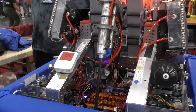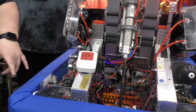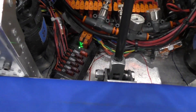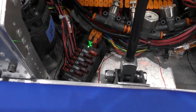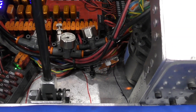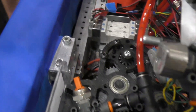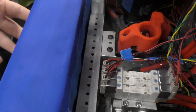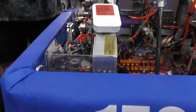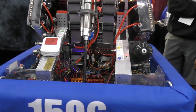So how much weight do you have? Do you have any weight in the middle for your center of gravity to be pretty low? Yes, we put steel in the base right here, which allows us to keep that low center of gravity when we added weight to our intake after our first two district competitions. We have steel bars in almost all four of these areas, as well as steel in our bumpers. The robot weighs 102 pounds, so we are a lighter bot, but we still have that low center of gravity.